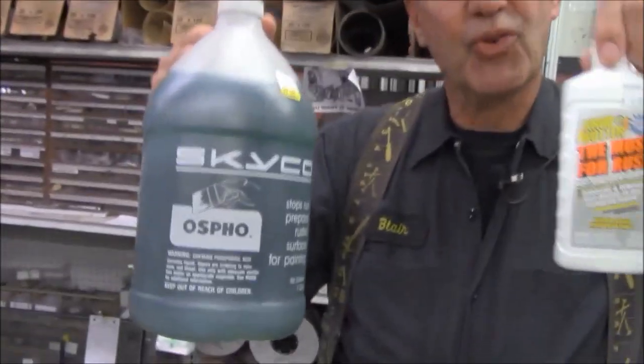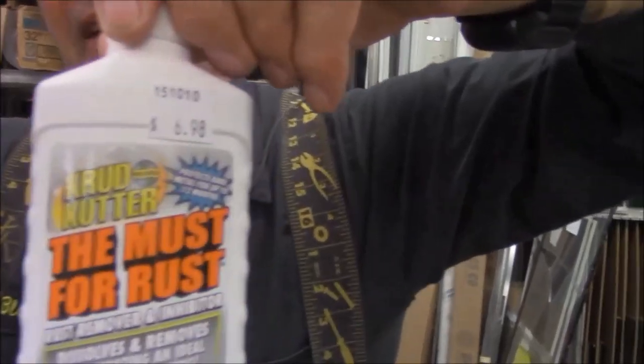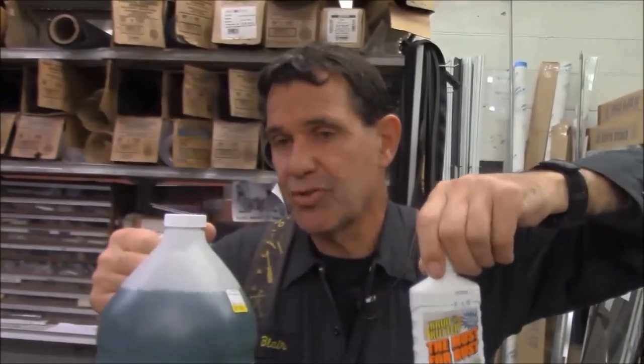These are both phosphoric acid-based products. They are mild phosphoric acid — they're not very nasty. I'm going to wear some gloves; I've used it plenty of times without gloves, but I've always had water to rinse my hands with. What this does is the phosphoric acid reacts with the oxygen and the rust, pulls the oxygen out of the rusting metal, and leaves the metal primed and ready for a coat of oil-based paint as our recommended first coat.